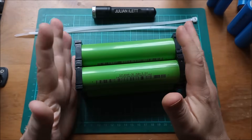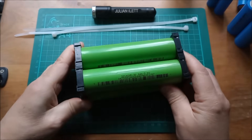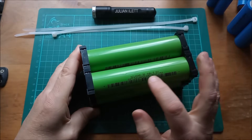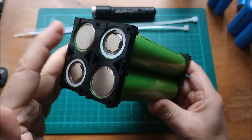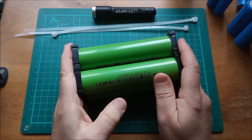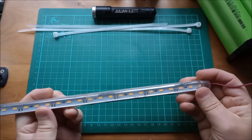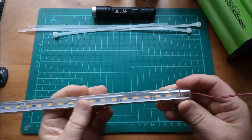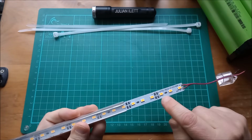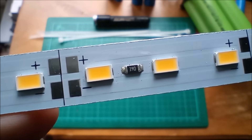It will be interesting to work out how to deal with the voltage range. Although nominal is 3 volts per cell, so this pack of 4 cells has a nominal voltage of 12 volts, the minimum cell voltage is 2 volts, so the pack starts at 8 volts; and the maximum is 4 volts per cell, so the top is 16 volts. That might create issues for LED strip lighting in the shed. Here's one of the lighting strips - about a foot and a half long. Each section has three LEDs in series and a resistor.